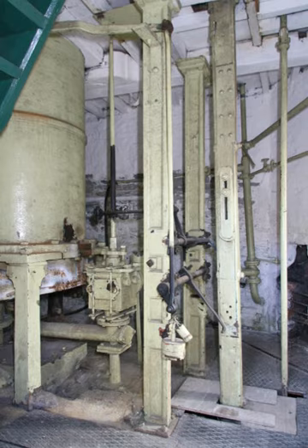Although the centrifugal governor was already known from its use for water and windmills, it was not until 1788 when Watt was the first to apply it to a steam engine. This was the 'lap engine', an early rotative engine now preserved in the Science Museum, London. With a rotative engine, it was necessary to control the rate at which an engine moved throughout its stroke, not merely to vary the timing between strokes. This required the use of a throttle valve in the steam supply, controlled by the governor. As the load on mill engines and similar uses could vary, closed-loop control such as the engine speed-based centrifugal governor was also needed. The cataract was thus not used on rotative engines, not even where single-acting Cornish winding engines were still used in Cornwall. Cornish engines were not amenable to control by a throttle valve, as their operating cycle depended on the condensation time more than a throttled steam supply. Non-rotative beam engines also had no easy means to drive a centrifugal governor. For these reasons the cataract remained in service for as long as the Cornish engine did.